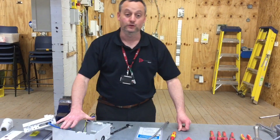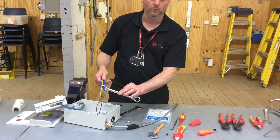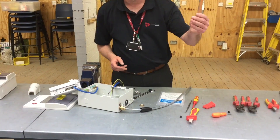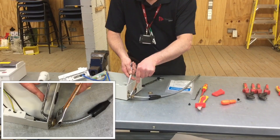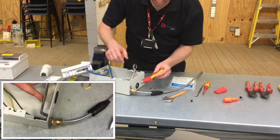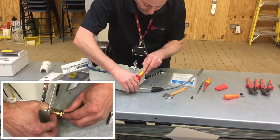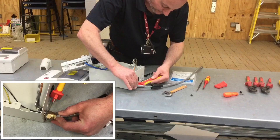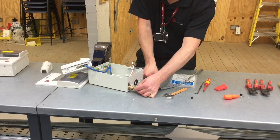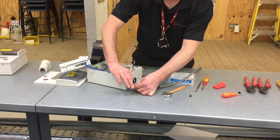The gland now needs to be fitted to our enclosure, which would normally be screwed to the wall — this one is here for demonstration purposes. Using the same 20mm lock nut spanner used with the steel wire armoured on the inside, a roofing nut and bolt hold the earthing ring in place during tightening. An adjustable spanner holds the body on the outside while we tighten the lock nut from inside. Ensure the braiding stays within the body as we go — press it into position with the back of a knife all the way around.